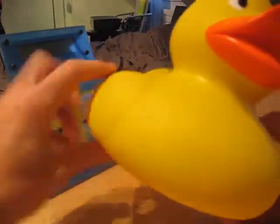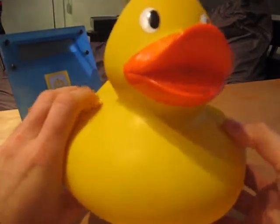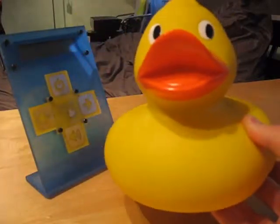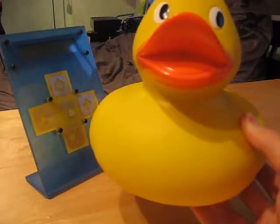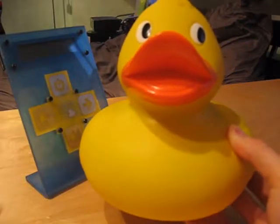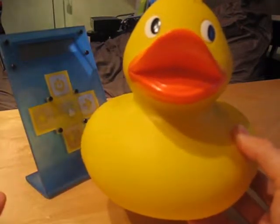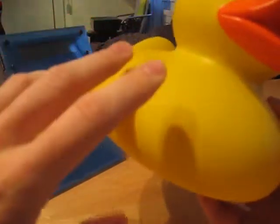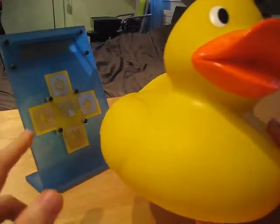The detector is mounted into a bath ducky so the duck can float above the water and follow the motion of the waves. For example, if a child fell into the water, it creates waves and this duck is able to detect waves using a three-axis accelerometer. Then the duck sends a signal to the base station and the base station triggers an alarm.